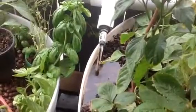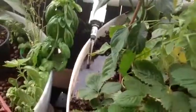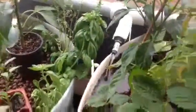So I'm getting good flow rate on that. As for the return line for this system, I'm going to move back away and show you the underneath side of the project. I have it coming down through the table, and then here's a 1.25 inch pipe that carries the water back into my sump tank area. And this one here connects right to the bottom. It's 3/4 inch down through the bottom of the drain, and it comes into this 1.25 inch.